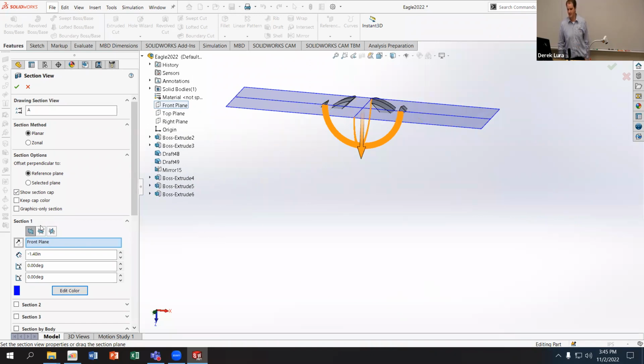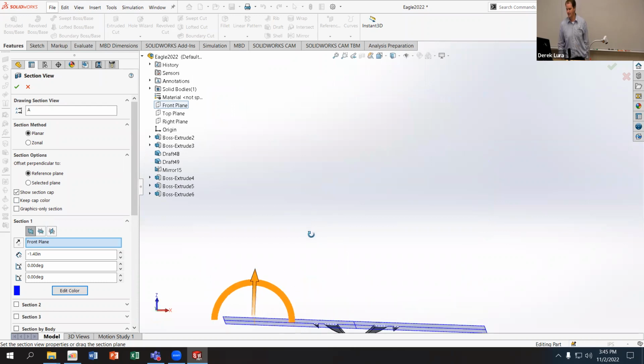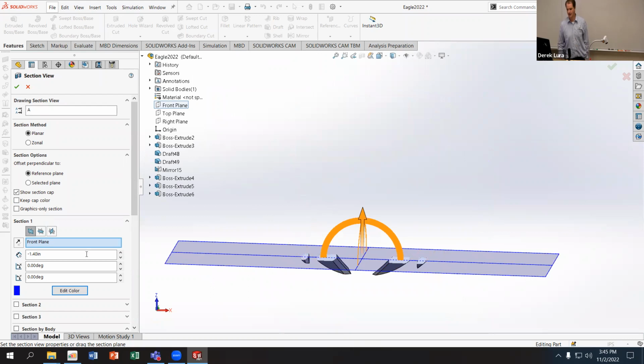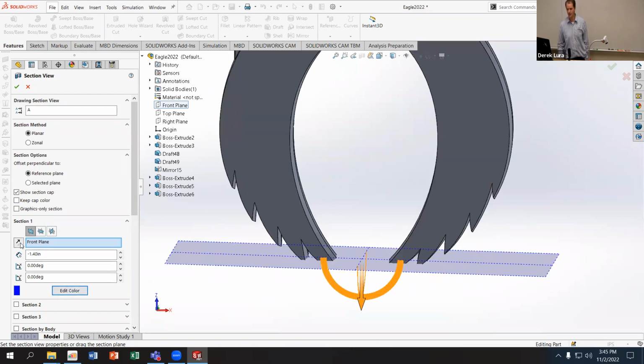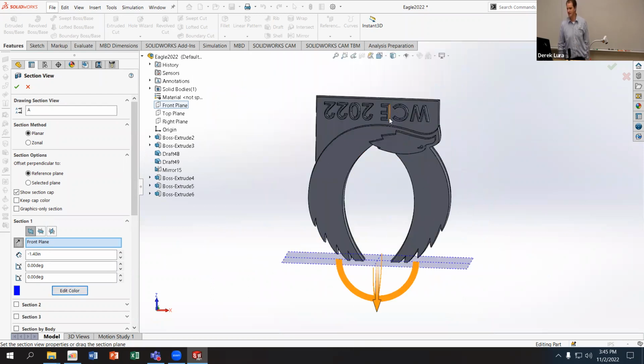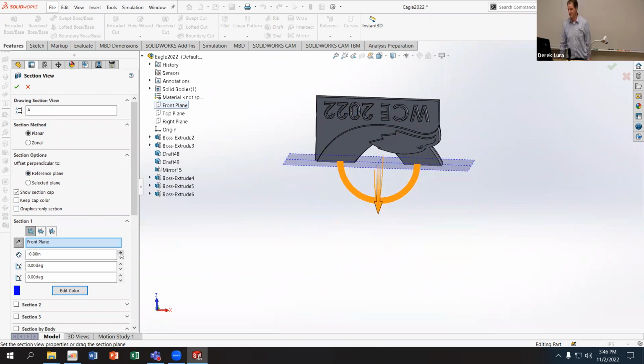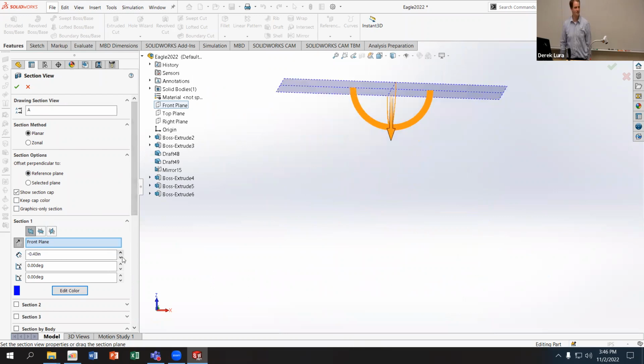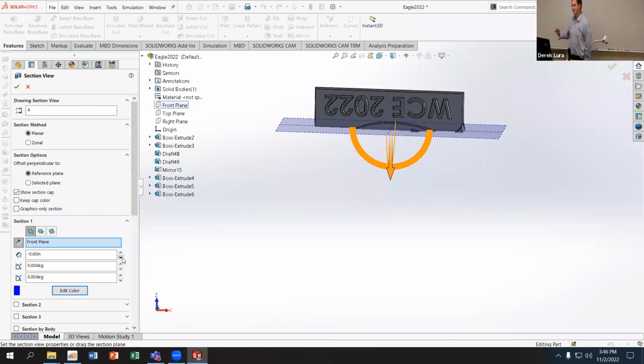If I flip this around the other direction and I'm filling this up from top to bottom, all the material is going to flow down into there. All the thing above this, that's all one piece. So now that's my void space. Again, this is now the feathers pointing down as the fill direction. So my void space here is continuous throughout the entire fill volume, which means that I only have to have one or maybe two channels to allow those gases to escape.